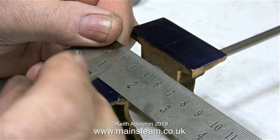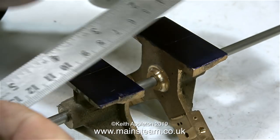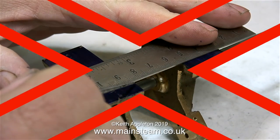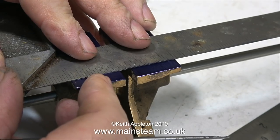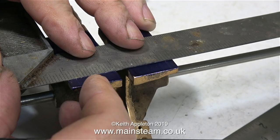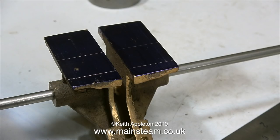The first part of the job was to find the centre position, then make a mark three quarters of an inch away from the centre position at each side. I need to do this on both of the standards and draw a line between the two. The bases of both standards need to be identical, and the part of the base at the front is already square, so I'm using that as a datum. By marking the lines using a set square, the lines are parallel with each other.